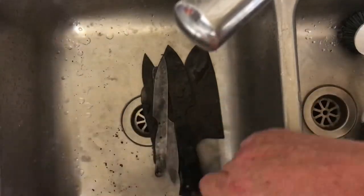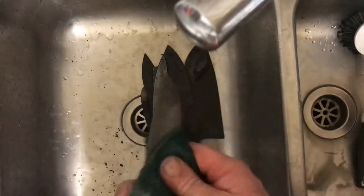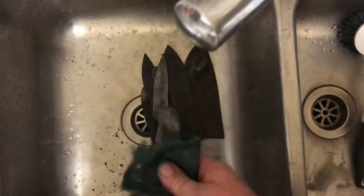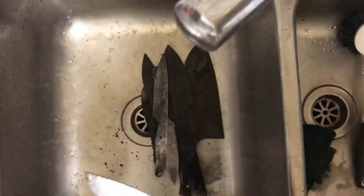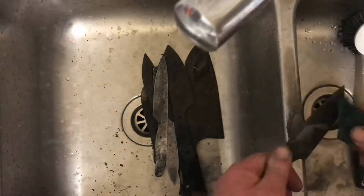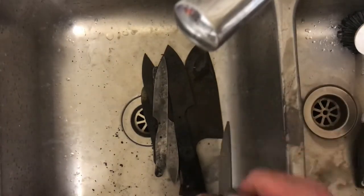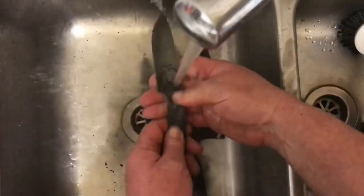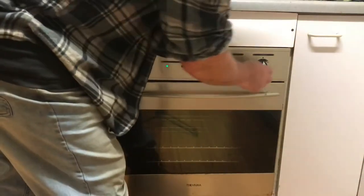We are inside and it's time to scrub up and get the oil off. As you can see, I had a few knives going at the time — some are stainless steel, some are carbon steel. Because of the different ways they're treated and the different tempering, I'll do them together but then they get separated back out for temper. The main thing at this stage is to clean off all the oil and gunk so it's not baked on in the oven.